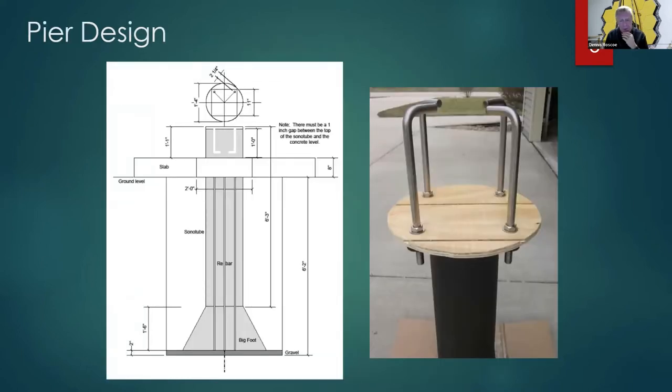Being a permanent observatory, I wanted to make sure that the pier was rock solid. This was probably an overkill. After doing a lot of research on various designs, I learned about things like the frost line, and how you have to get below it. I learned that I needed to get below the frost line and put in one of these Bigfoots, because it doesn't really matter even if you go past the frost line, if you don't have an anchor down deep,